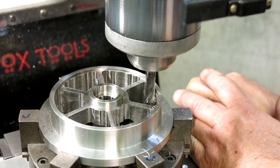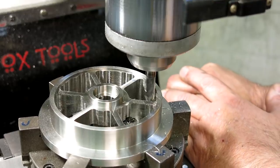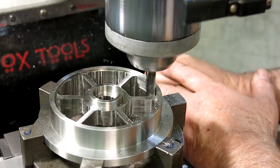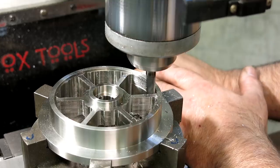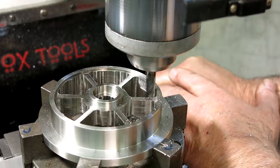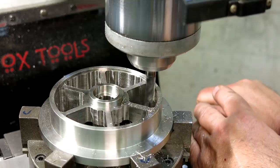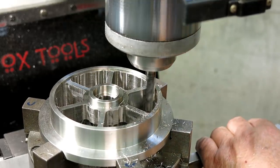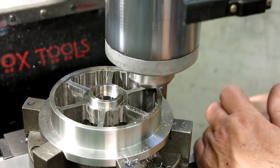That stabilizer is really working good. So I just go to the stops. I don't have to watch a dial or do anything weird. I can pay attention to smooth and steady feeding like that. Now this is the only nervous part for me, the climb cutting coming back, but it's this tool spring pressure that we're dealing with. I'm going to get greedy and do the whole thing.